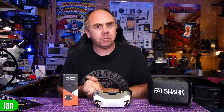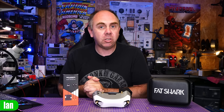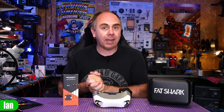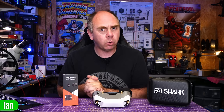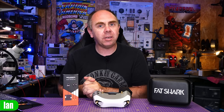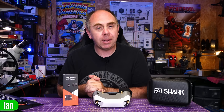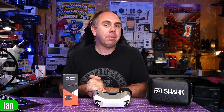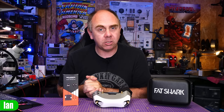Moving over to the VTX, and there are some annoyances here, the biggest being the 25.5 mounting pattern. It just makes installation into a traditional 4 or 5 inch frame difficult, and it doesn't install easily into anything I had. Furthermore, it's also annoying that the micro camera version comes with a shorter MIPI cable, and the fact that you can't use any of your existing DJI ones means you're going to be stuck trying to shoehorn this one in on a traditional frame towards the front and not be able to put it at the back like many frames have been designed to have VTXs installed in.